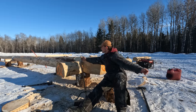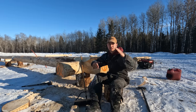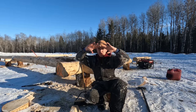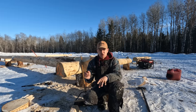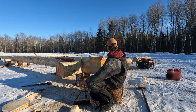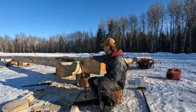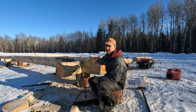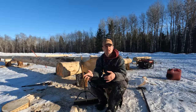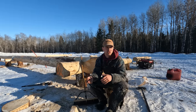My saddles are really steep, and that made it really tricky to notch, really tricky to profile so I wouldn't have recurve. Because my notch has to be like this, so it'll come and slide down. I can't have a notch that hooks down in the bottom. It won't even fit. So really tricky. But I got this big sexy log here, and it really adds a lot of character, a lot of mass to the front. Like in this instance, instead of weakening the top log by cutting so much out of it, I leave that block of wood in there, which is not ideal. This is not efficient. This is not a good selection thing. We'll see what happens as we move up, but I am able to make it really strong this way.